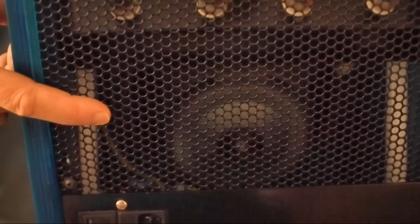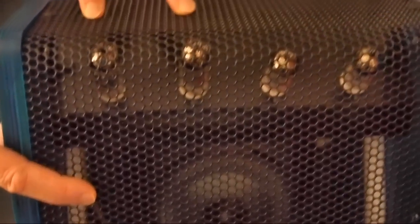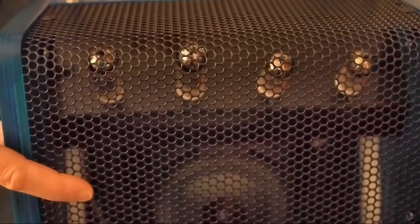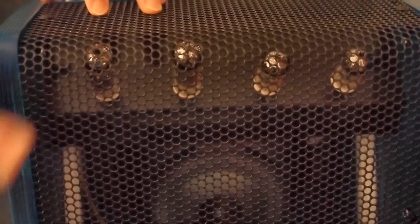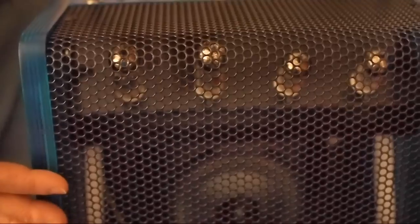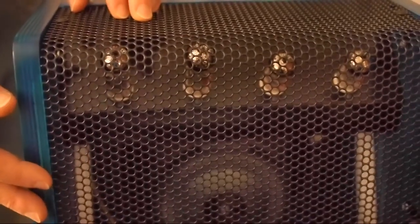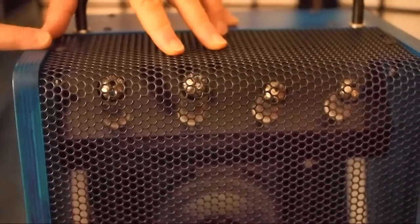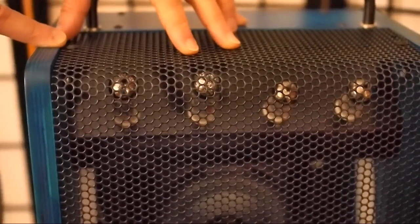Inside, there's a switch for selecting the output tube bias level. That means you can run the output tubes at a normal 70% dissipation or really crank them to 100% like the EL84s in an old AC30 were. It's a hot sound. It shortens the tube life, but if that's the sound you want, it's great to be able to get that option at the flick of a switch.